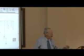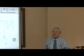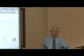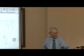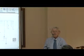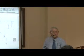And those are the little mistakes that I made. And I don't know about you, but you see it, you know exactly which breaker you want. It's the one in the top left. And I don't write it down because I know it's the one on the top left. Why should I? But some poor person who's getting it doesn't know that that's the one it is. So the documentation is critical. Making sure you're very, very thorough is critical.